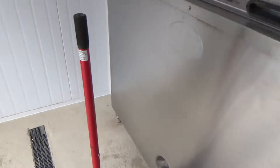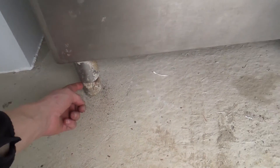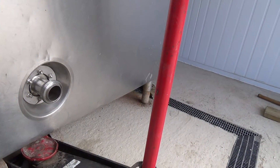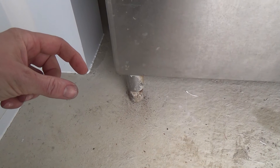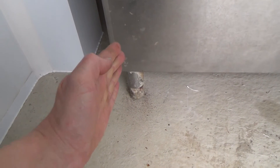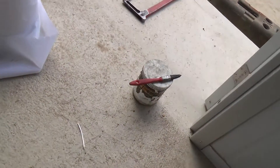The ones on the left-hand side were quite rusty. We've got two different lengths of leg here — the threads are the same length, but the actual steel section is longer on the right-hand side. Luckily the floor slopes that way, so those ones aren't screwed in most of the way and these ones are out a bit further. We had to take these out — the thread's quite coarse, so I usually just run a hacksaw blade, set it in the threads at a bit of an angle and saw through it, and that cuts all the rust and crap out of there. Then we put some copper grease over the threads.